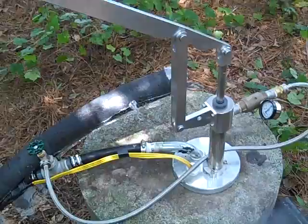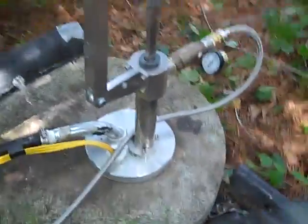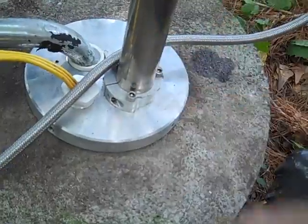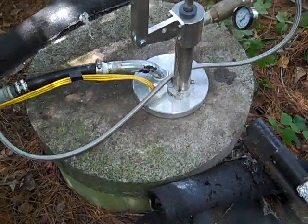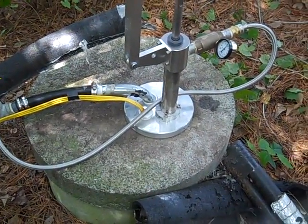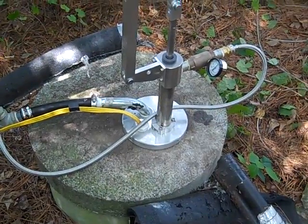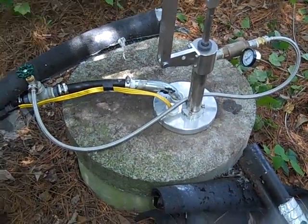It makes a very nice, clean setup for a backup system. With the bored well, I just leave the handle on it — it won't freeze. There's a drain-back; we pull the drop pipe in about 48 inches down, so it will not freeze. It's hard to beat that for a backup water delivery system. Let me know if you have any questions — engineer 775 signing off.